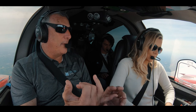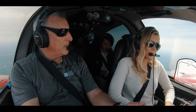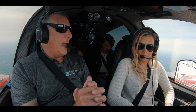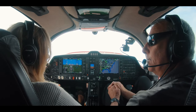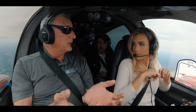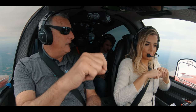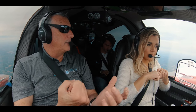But they just had to basically make the cooling system fit in the cowling, make the radiator fit underneath in the middle, get the ECUs tuned up just right so they could manage everything, and just make sure the turbocharger was going to be able to manage the right altitudes for this set of the engine they wanted. We don't have spark plugs or magnetos. Literally, there's just a piston, and there's just a metering of the fuel into the piston to burn the jet fuel, and it's just compression.